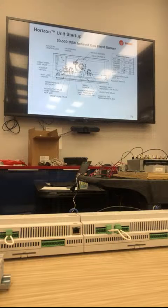The one thing we're asking is low fire. How many people know that what typically was our low fire is between 0.2 and 0.3? Yep. We're asking low fire to be 0.4. Did you change the nozzle or something? No, we are seeing a lot of issues with the flame blowing out.